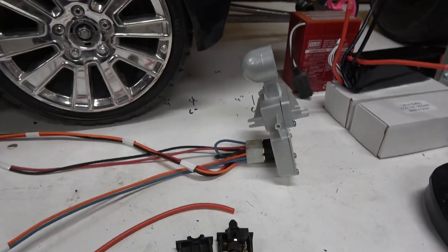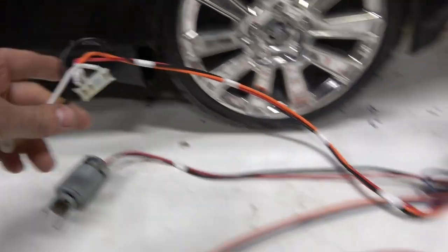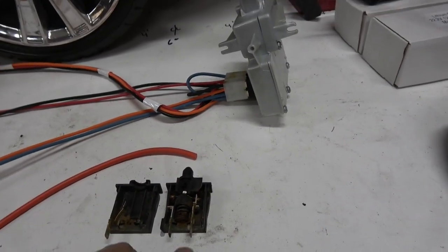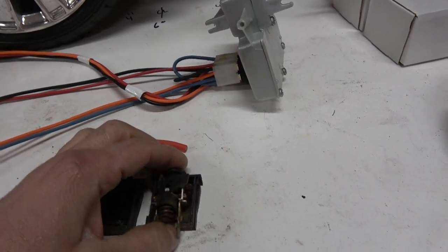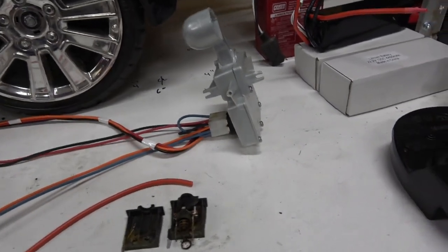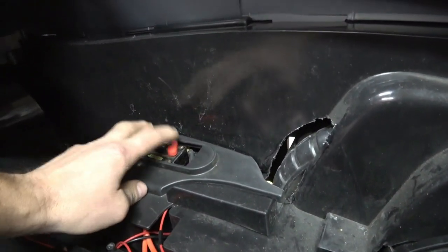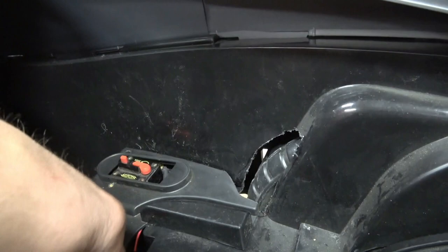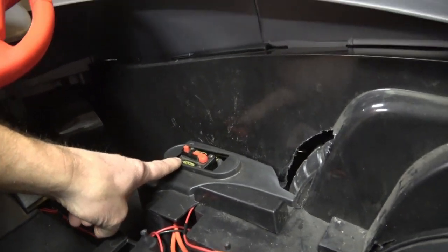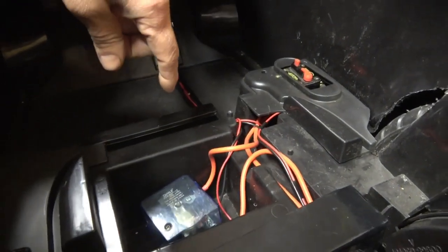The reason you want to redo the wiring: out of the battery it goes into the shifter, but that shifter switch is weak — it's not made for all these amps. Out of the shifter it goes into the foot pedal, and I can guarantee eventually these will weld shut. The arcing welds the contact closed — it's happened twice to us and it's unsafe. With the kill switch, all the driver has to do is press it to cut current from the battery to the rest of the system.